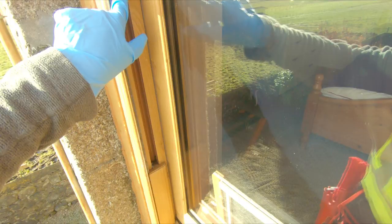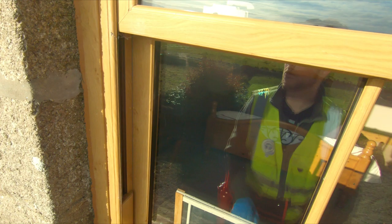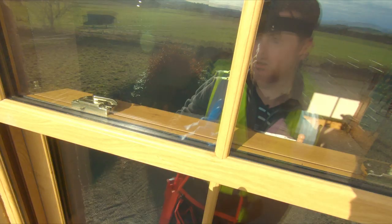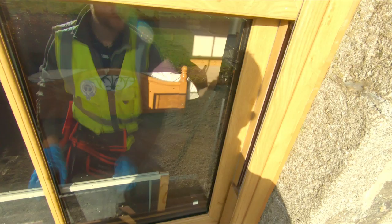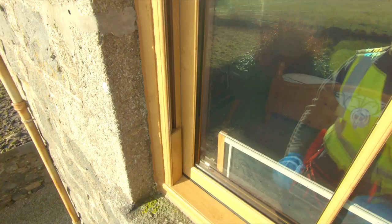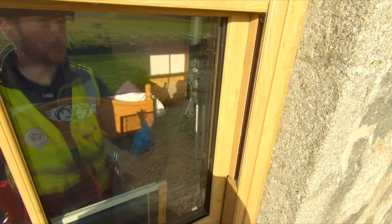You've even got bits in here that didn't quite get with the brush — spider webs in there. The brush was tilted and scrubbed up and down, but this can still be better quality using traditional methods afterwards. There's a bit up on the glass that would need redoing with soap and bronze wool. It's taken the worst of it off, but this is one of the major reasons I wouldn't rely solely on waterfed pole for a first clean — it just doesn't get everything off the frames and glass. From down there it looks clean, but up on the ladders you can see bits that didn't come off, not visible from 20 feet down.